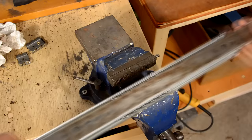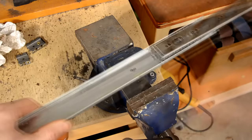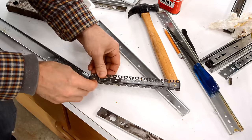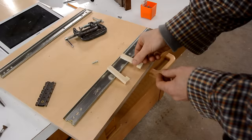Very carefully bend this in a little bit with a vise, then check if there's play. Still loose right there, so I'll squeeze that some more. Now putting it back together with both ball cages but not all the balls, because I'll have to take this thing apart a few more times before I'm done. It slides without play and it slides smooth. I'm adding countersinks with a larger drill here.